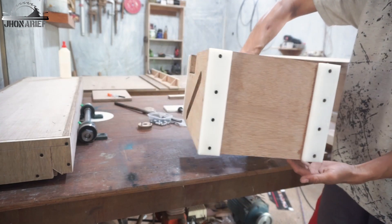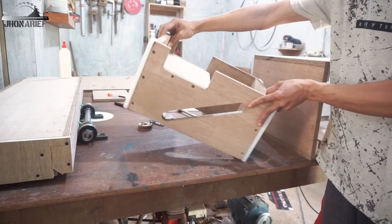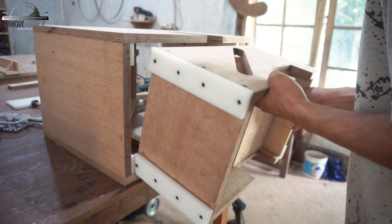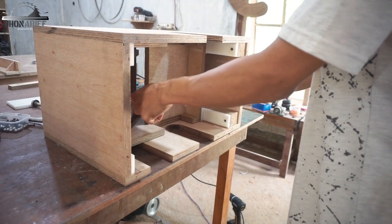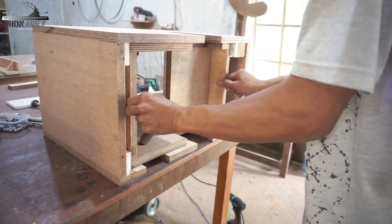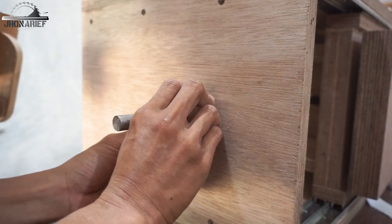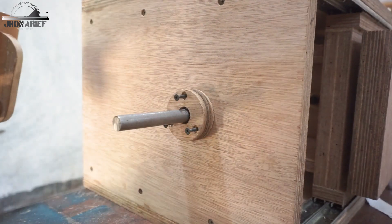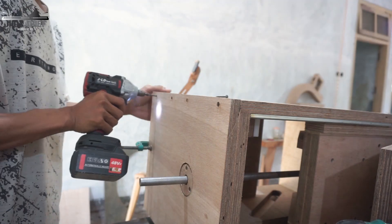Next step: I'm going to insert the small box into the big box, and this is going to be our blade lifting mechanism. As you can see, when you use HDPE or nylon it creates a smooth slide with no wobbling — it fits perfectly. Next we're going to add the trapezium threaded rod for the mechanism to pull and push the motor slide. I also add a bearing so that when the threaded rod turns, it doesn't make any squeaking noise or become hard to turn.